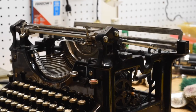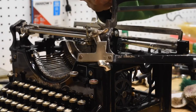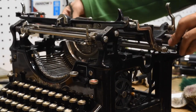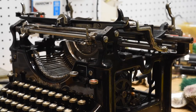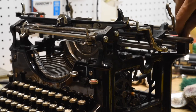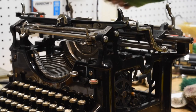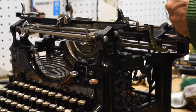Installing it is easy. We're going to take the carriage frame again and line up the two square brackets on the back end of that rod and place those over the two posts on the edge of the machine. Then we take those two screws we just removed and put them in the opposite ends to hold down the bearing rod on this carriage.